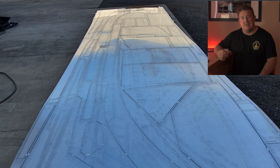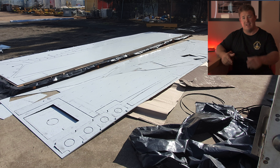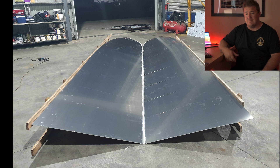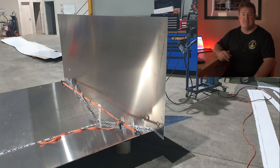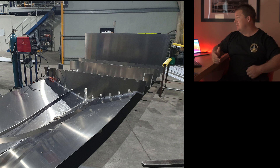So that's basically what the boat comes as — it's a flat sheet that's just CNC cut. You go through with the carbide cutter, cut out each piece individually, and they're all laser-etched so you can tell what's what. You can see here the first two hull sheets are down. We kind of set them in place, then used some timber to pack it up and get it set up where we needed to. And there's the first weld on the boat. This piece now is kind of the back frame — that's actually the inside of the transom.